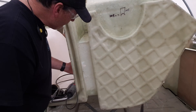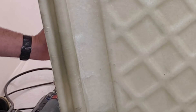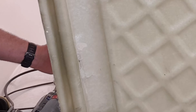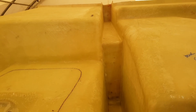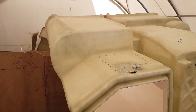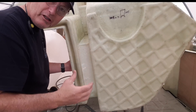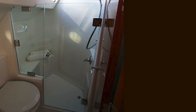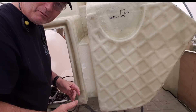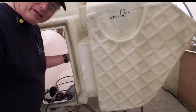Another thing I need to do is deal with the damage that was incurred when that mold fell in — that's crushed that step there. So I'm going to need to physically remove what's there and somehow mold it, probably just simply with tape. There's going to be some restorative gel coat work on the other side. I also need to tidy up all the way along this recess and apply a lot more reinforcement — probably another two or three layers of 600 double bias in here to really beef this up. This is a step between the shower and the toilet, and in any rough water your body weight could seriously do some damage.